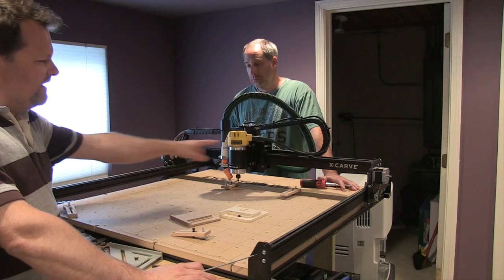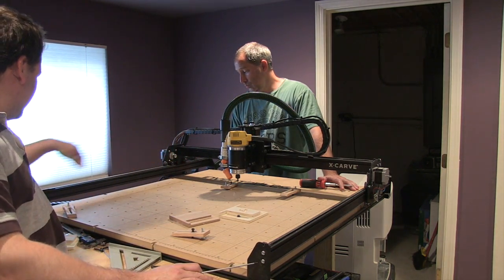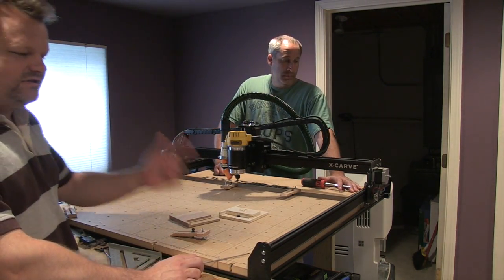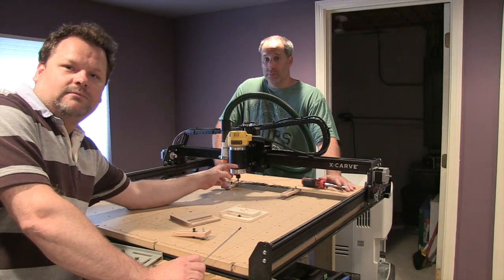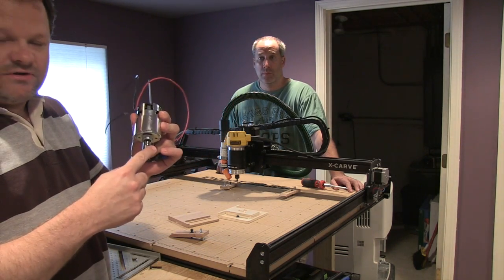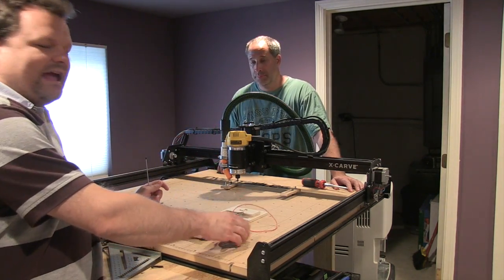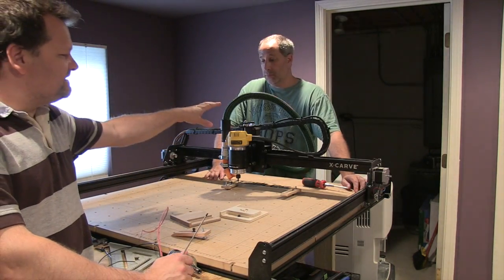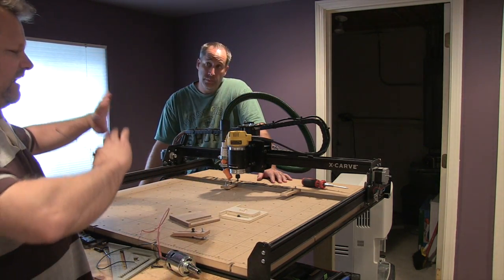This has the upgraded stepper motors on the sides. The belts were a little tricky at first — I realized you have to put heat shrink on them to lock them so they don't slip. I would get them all in and all of a sudden they would slip and I'd be back to square one. That was frustrating until I saw someone post about the heat shrink. I also replaced the router it comes with — this spindle here — and put on the DeWalt DWP-611 router. I'm cutting MDF and it figures out all the equations for you.